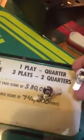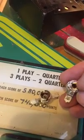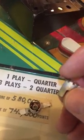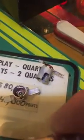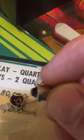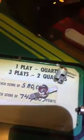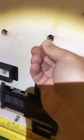That middle spring should be attached, or make good contact with this copper or brass center to transfer the power from the wire to the light bulb. The other part of it is right on the edge, where that little cut is. The little nub of the lamp socket has to have a nice tight connection there, and if the corrosion's there too, it won't help either. So the first thing I'll usually do is use a wire brush with a drill and just wire brush the insides. If it's not too bad, that can usually fix it.